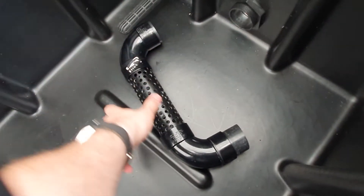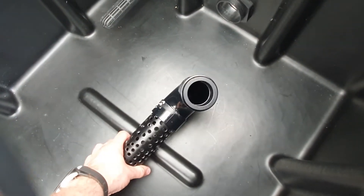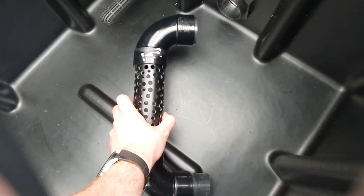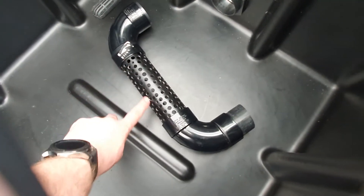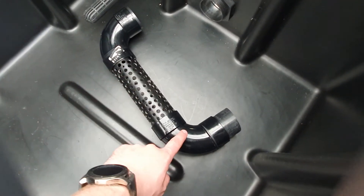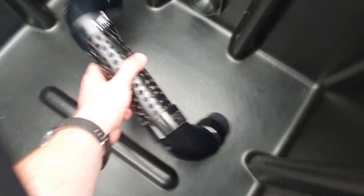So how have I adapted it? A two-inch to two-and-a-half-inch adapter, a two-inch 90-degree elbow, a strainer that I made yesterday — and these two bits I had yesterday. So a two-inch connector and a bit of pipe there.